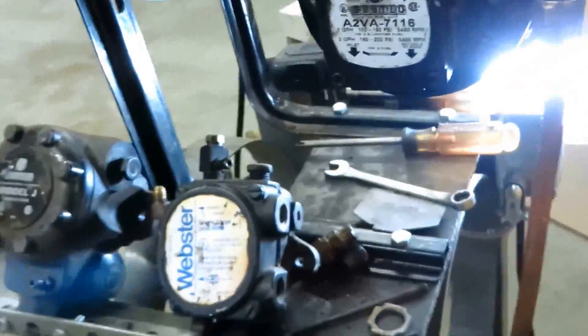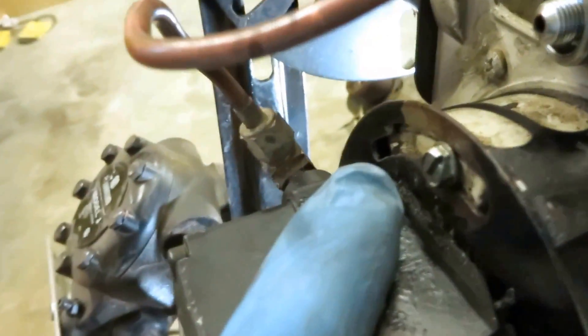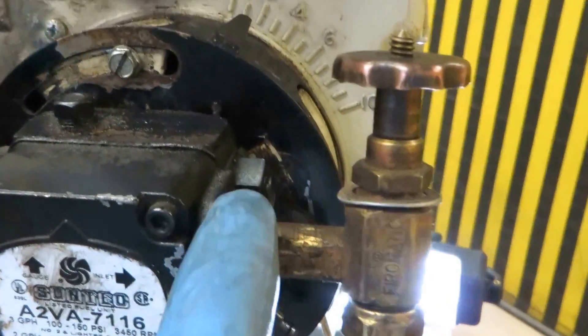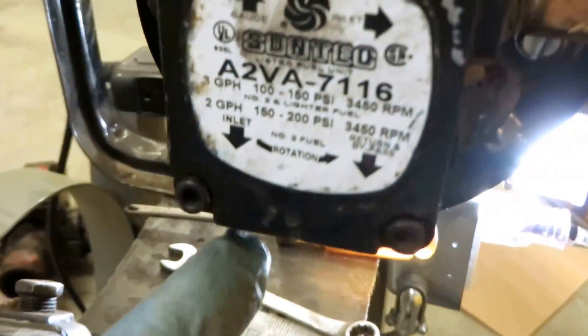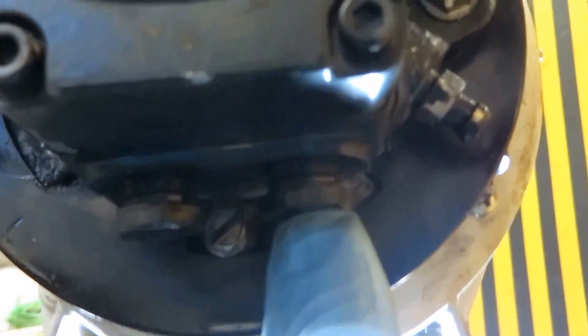I'm going to talk about the pump a little bit here. This is a single stage pump, 3,450 RPMs, no delayed oil valve — just a standard SunTech pump. You can see the rotation here. You've got an inlet here that comes in — usually you put your firematic valve here. You've also got another inlet on the bottom if you wanted to put the inlet there. And then there's a bypass which is a return line. If you wanted to turn this into a two-pipe system, you could take this plug out on the return and install a little allen screw — it's called a bypass plug.